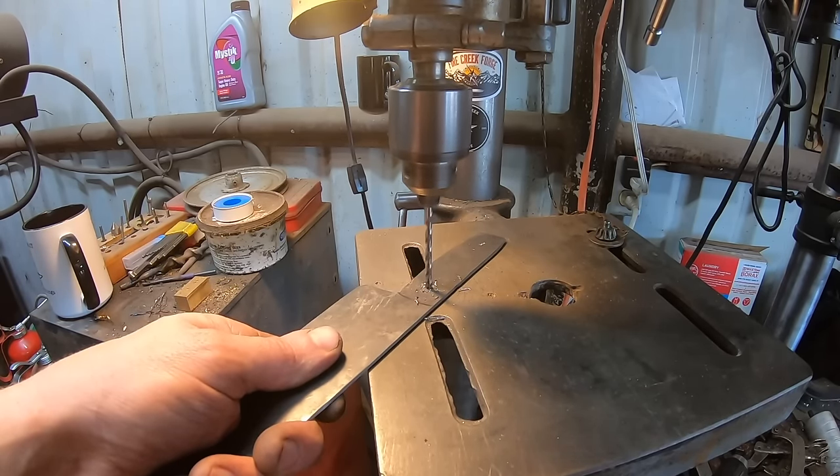Well, I was able to get holes in it with the carbide burr, but the stainless steel did not soften hardly at all. So this 416 stainless, I believe, is a martensitic stainless steel, which means it does harden, obviously. It's not a blade steel or anything like that. It doesn't have that kind of carbon content in it, but it's not gonna probably work for doing it the way I was trying to work it with the traditional Japanese sanmai bladesmithing techniques. I might have to go with a 300 series.